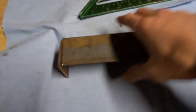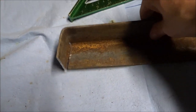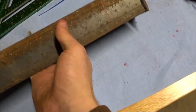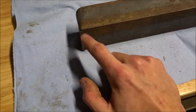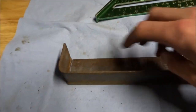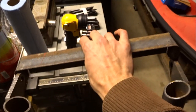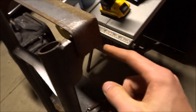The tabs are bent over, so I kind of have a box here. I'm not going to just leave it like this — I'm going to take my welder and run a bead right here and right here to weld this up and fully box it out so it can't spread. I did test it on the tabs and as you can see both sides it slides over, which means once we drill a hole we can throw a pin through each side and it'll be good.